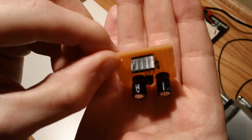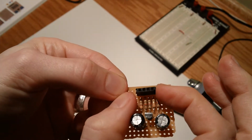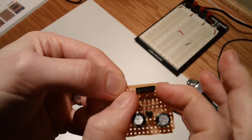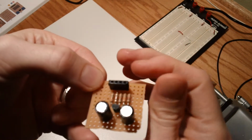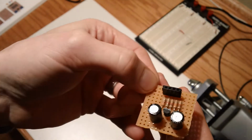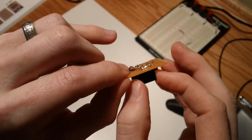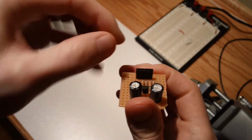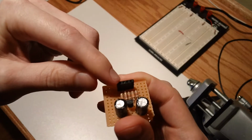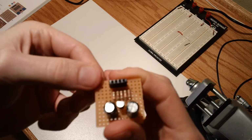They more like shatter. I put this in my little vise and tried to snap off a nice single section of four input pins. I ended up having to try three times, and I kept breaking off chunks of three pins at a time, and you'd have pieces of plastic that were cracked on the ends. I just couldn't get a nice clean snap. They look a little bit different from the female or the male pin ones, the opposing ones that you could put into these. Those ones actually did have nice dimples to snap them more cleanly. So anyways, the purpose for this is so that we can interchange our LED and the power supply and be a little bit more flexible with this design.